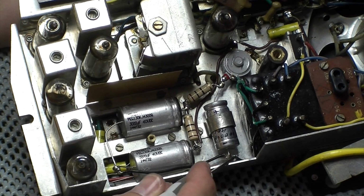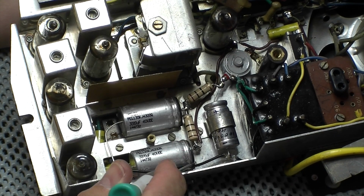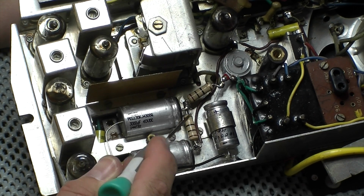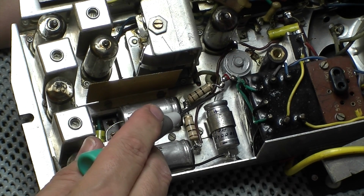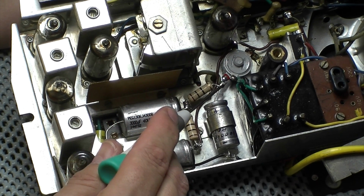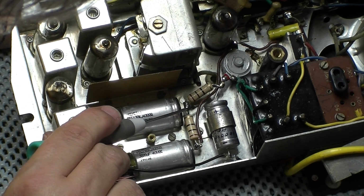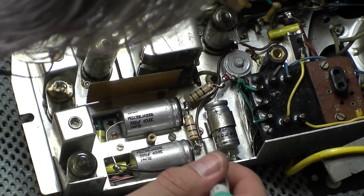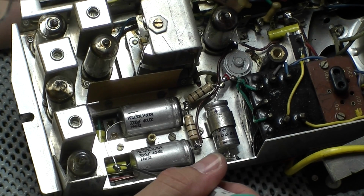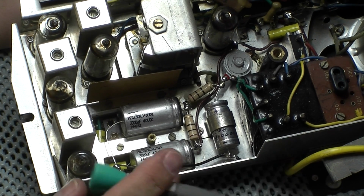So yeah, basically we've got all our negatives tied in together up onto the transformer. I've now got the new resistors in. We know their correct value. So all the positives come in through into the selenium rectifier. We've got another cable coming up through there, tied onto the back of the selenium rectifier. Yeah, that's say I've wire wound all these. Got a clamp to go back in there, but apart from that, we're good to go.